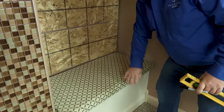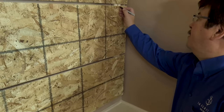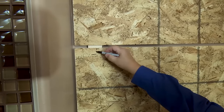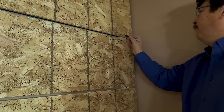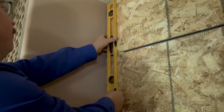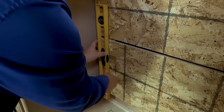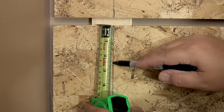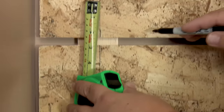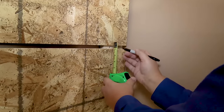All of our panels are now mounted to our mounting boards. We are marking the center location where the mounting board rests underneath each panel with a Sharpie marker. Using a level and positioning it on top of those marks, we will strike a line going down the entire length of all of our panels so we know where to drill a hole for our bow clips. I like to install four bow clips in each panel, so at the corners — obviously over top of our mounting board — I like to mark about two to two and a half inches for where each hole will be drilled.